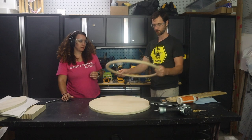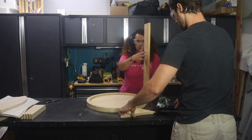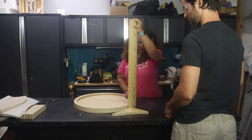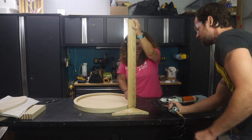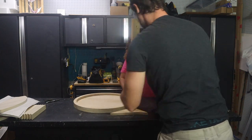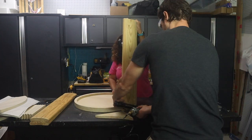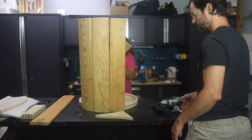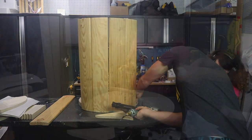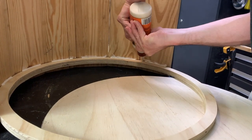Now it's time to add the side panels. We put the wood ring on top of one of our wood circles to ensure it is at the right height inside the ottoman — this will be the lip for the lid. We use a spare scrap of plywood as a guide for nail placement with the nail gun, adding one panel at a time and tacking them in with about three to four nails. We reinforce with wood glue, putting it into that little crevice.